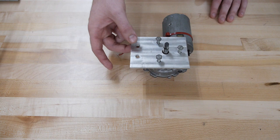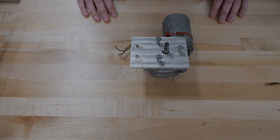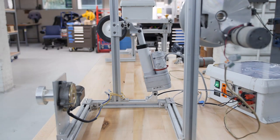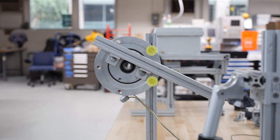On the other side of the motor mount there are two clearance holes drilled which allow fasteners to pass through them and clamp the mount itself to 80-20, therefore securing the motor to the frame. The only motors that do not need motor mounts to connect to the frame are the linear actuators, which use clevis mounts, and the globe motor, which connects directly to 80-20.